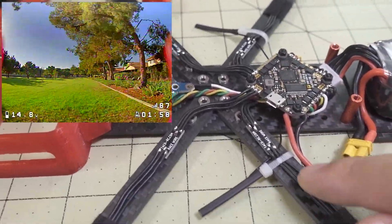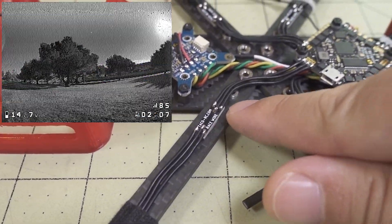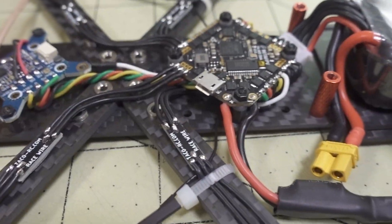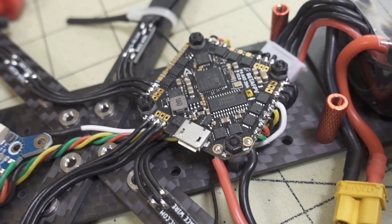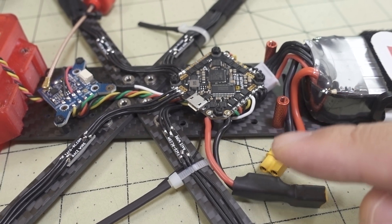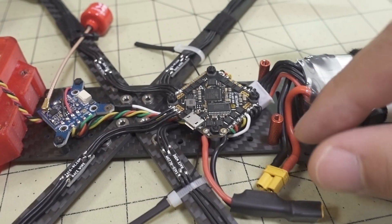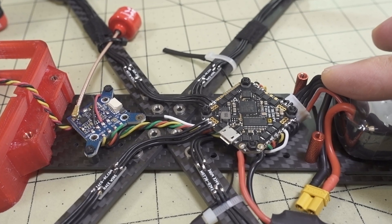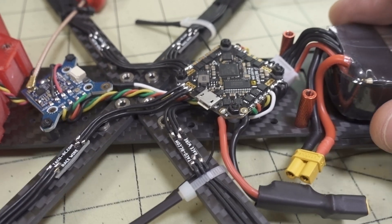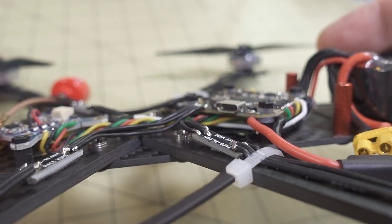Because the arms are very long, your motor wires typically won't reach the flight controller, so you'll need some race wire or LED race wire to extend the motor wire length. I'm running a BetaFPV all-in-one board, the 20-amp version, but I rotated the board so the power plug exits to the side — keeping those parts out of the camera's view. Also be aware of USB port orientation so it doesn't get blocked.